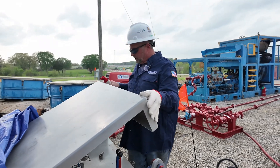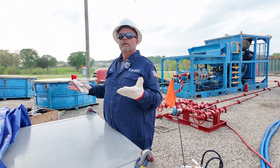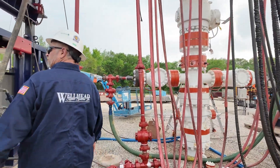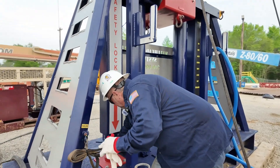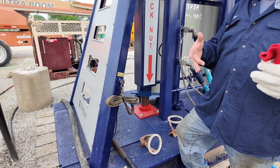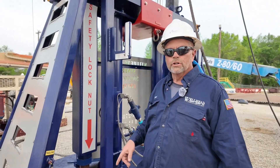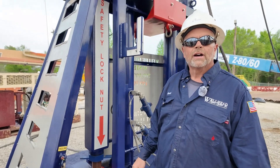Every morning we check it out. The heat of the day is your friend — the heat expansion will give you a little bit of uplift as well. We'll maintain at least that 60,000 pounds. Since we've stacked more weight on there, if I know it's 80 or a hundred degrees or better — especially in this terrain — these safeties will get a little slack. I'll bump it up, and in the morning when I preload again to our 60,000, I know I've got hydraulic fluid going to the system. As the day moves on and the heat goes on, the safeties going slack means we're still giving that uplift — I may have 70, 75,000 on the system right now.